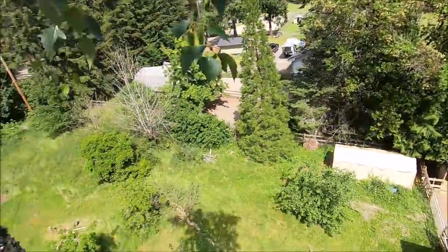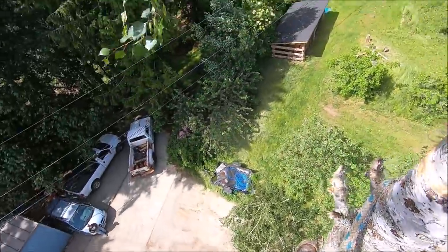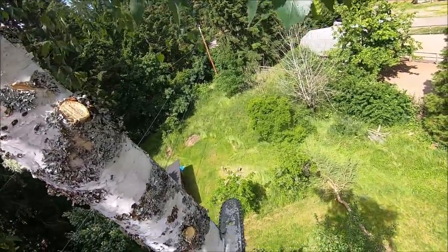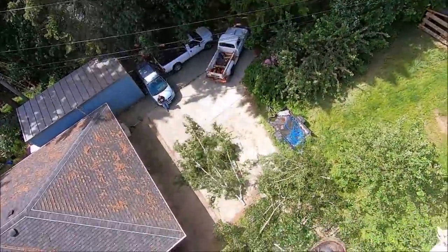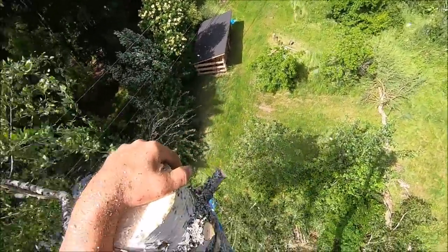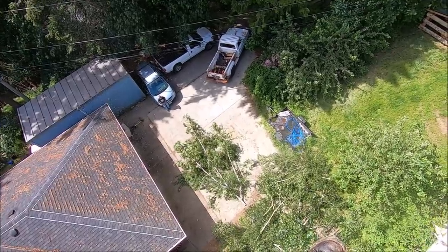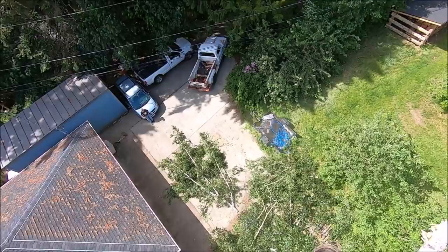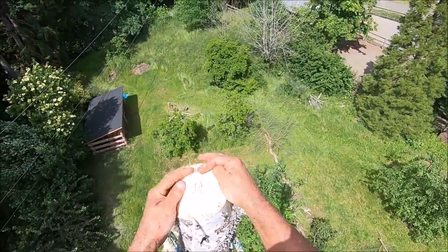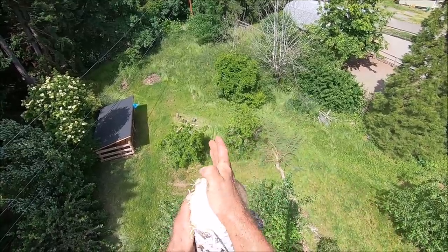Wait for the wind to settle and I'll cut this thing right off. Okay, here we go. Boom. Right dead square on path, okay? So there's the holding wood. The house is behind me, you see? So I left my holding wood high off the house to keep this off the house, even though I notched my sides. I kept a little strip in the middle, keeping it high.